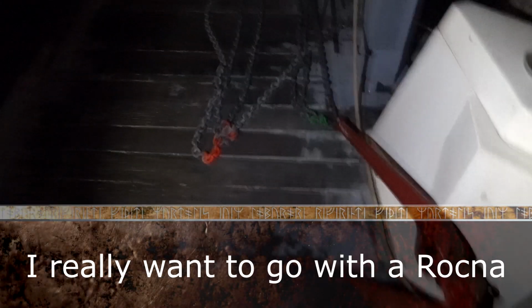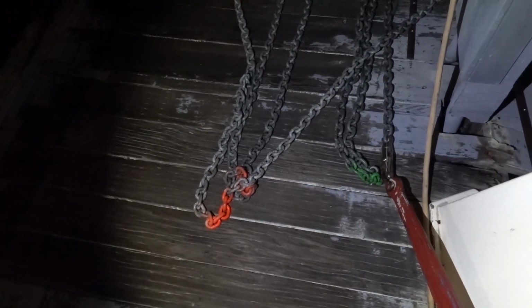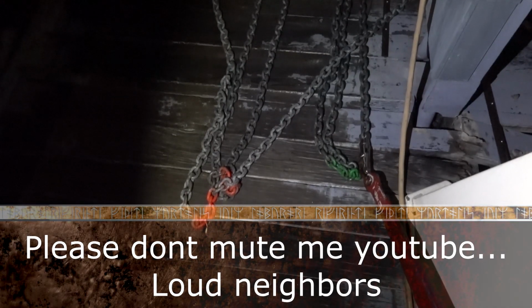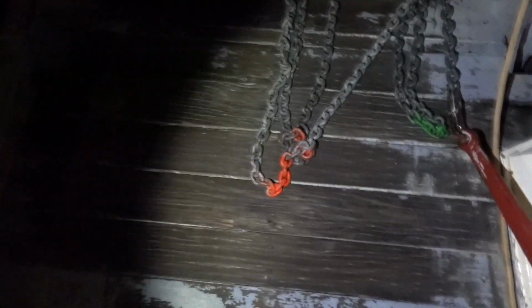So I'm gonna flip the camera around. Let's take a look. I'm using my flashlight to let you guys see this. This is the 45 pound CQR anchor. And then you can see here the paint dictates where the 30 foot marks are. And this here is 180 plus what's still in the water, and then the access off the boat.